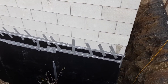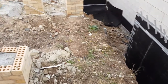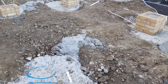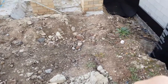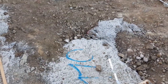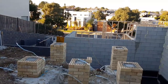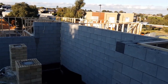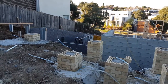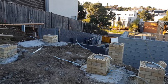There you have the next stage of this job in East Keilor, and we'll get back as the frame gets a little bit more advanced to show you more of the conventional building which will take place once all this ground floor subfloor work is taken care of. This is probably the hardest part of the build, and once these floor joists are all in, we're going to move back to conventional building and much faster production.